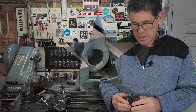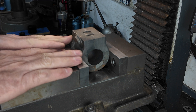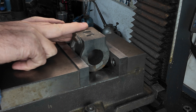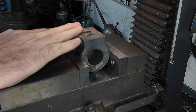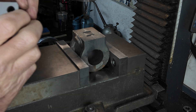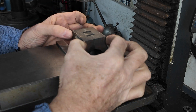This is the setup for the cylinder. We've done a bit of filing on the casting to get everything as consistent as we can. We want to get a reference surface, and I think the best place to start is this flat side here, so we'll just deck that off and have something to work from. I've put it in the vice on those two bottom edges and squared it up so that these sides here are vertical.